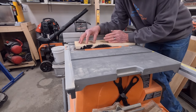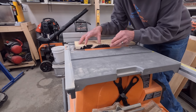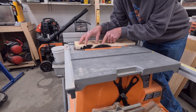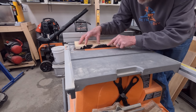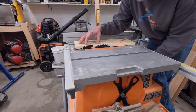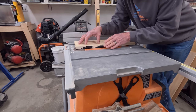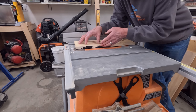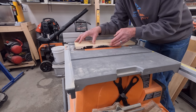Before we cut our wood, we want to set our blade at the proper height. The blade manufacturer recommends in most cases that the gullet — the notch between the teeth — is above the workpiece, so the bottom of that notch should be at the top of your workpiece. Some people feel better running their blade where the carbide tooth just barely protrudes through the wood, and that's okay in most cases. The gullets are designed to carry sawdust away and bring in cool air to cool the blade.